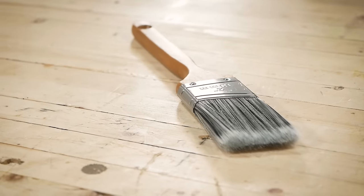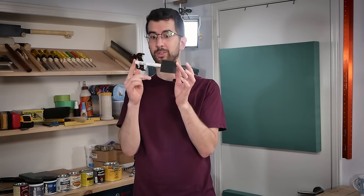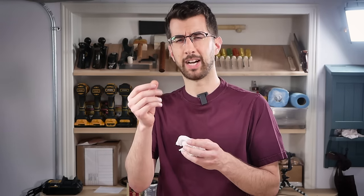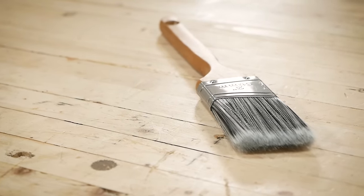I don't think there is a correct applicator. If you already have a preference between a bristle brush, a foam brush, and a rag, then stick with what you like. For applying pre-stain conditioner, a foam brush works great and makes the work go fast — just treat them gently with light pressure. For applying stain, I like to use a clean cotton rag. Avoid paper towels because loose fibers can remain in your finish. For applying a clear finish, I like foam brushes again, since I've never had much success cleaning bristle brushes. Also, the finishing process isn't done with the last application because I still have more sanding to do, so the brush strokes you see now won't matter later.